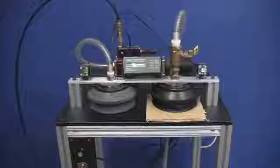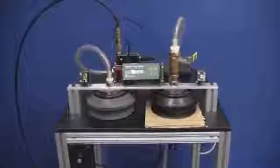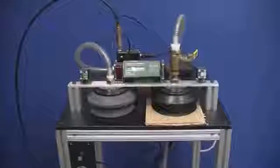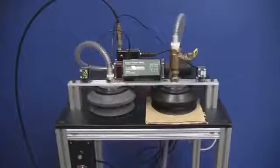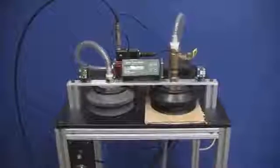The comparison of energy usage for mechanical vacuum systems to those using compressed air isn't always as simple as it seems. Very often the two technologies are improperly and unfairly evaluated. It's not always as easy as comparing catalog data and making generalizations based on ratings. It's very common to assume that the energy required to operate the mechanical pump is the same as the rating shown on the nameplate of the pump.